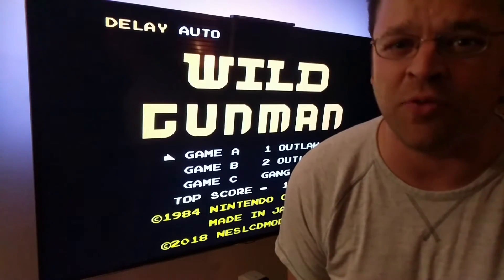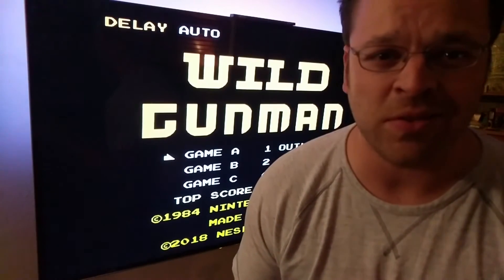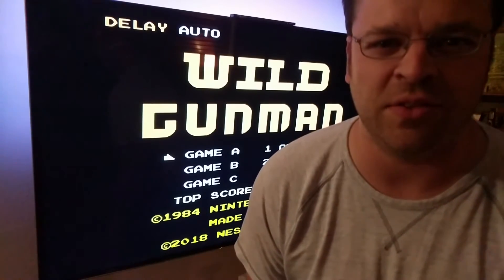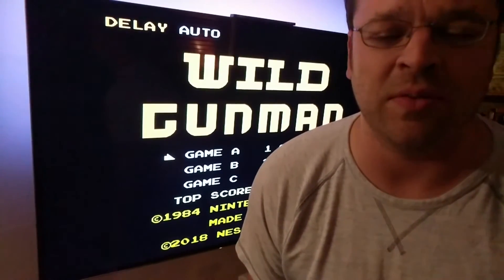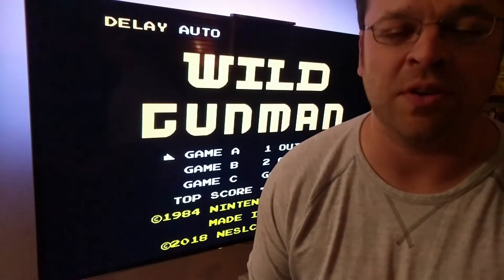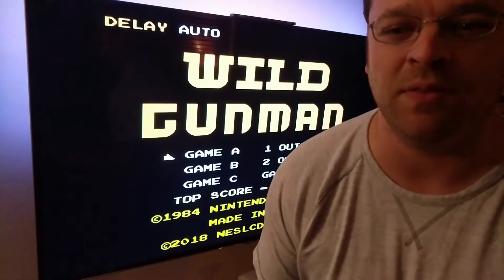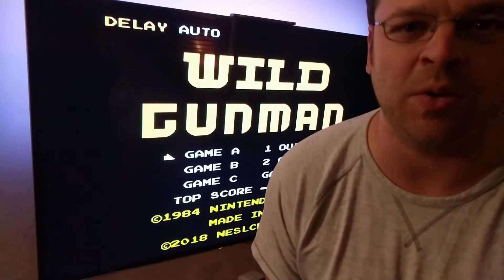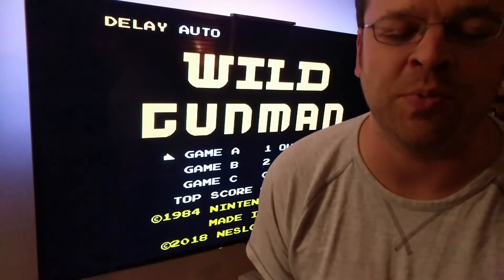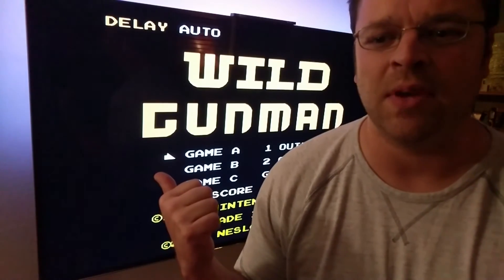I looked into the LCDs a little bit and I think they're backlit by CFLs, which is fluorescent, and from what I could tell those output infrared. So I did a little research to find out if they were infrared sensors in the gun. I wasn't able to figure it out definitively. The best that I know is to buy a Tomy gun, desolder the sensor, and put it in the NES gun. If someone smarter than me could figure out what photodiode that is, you could just buy the diode and put it in the gun. Make sure you put your TV in game mode and then do the tuning.